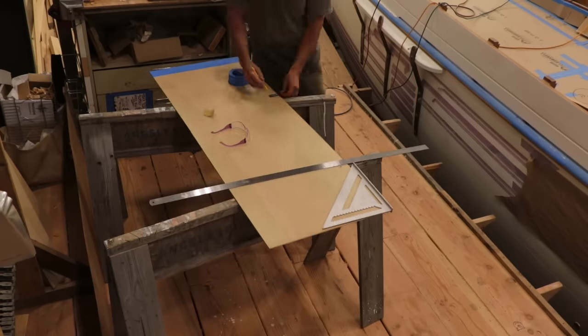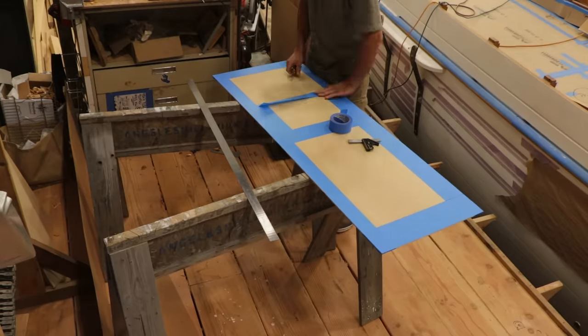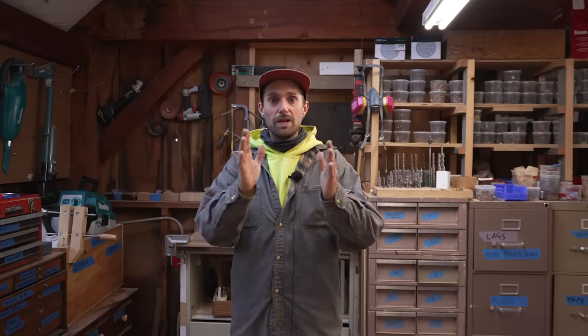So first thing was to make a pretty detailed mock-up, getting the height off of the countertop for the bottom edge of the cabinets, and how far outboard we wanted to put the face of the cabinets, and also to just get a feel for how everything looks with the space. Once we made a detailed mock-up and had all the measurements, then I could go ahead and make patterns for the vertical bulkheads that separated each cabinet bay. Those vertical bulkheads really take the weight of the whole hanging locker. So that was pretty fun and exciting. And important and hard, but fun.